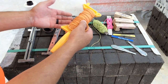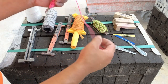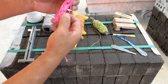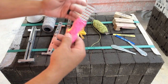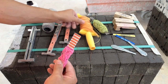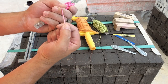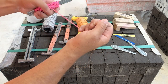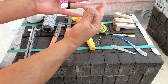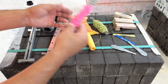If we're avoiding twisted line, what's the other alternative? We have what's called braided string line — this line is braided together like hair braids. It usually costs slightly more than twisted string line. Twisted string line does have a use; it's sometimes used by the site layout guys. As a mason, we want braided string line. It has a good amount of stretch and can be slightly nicked without coming unraveled, so it has good durability.